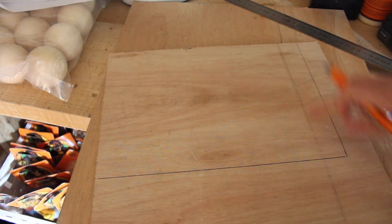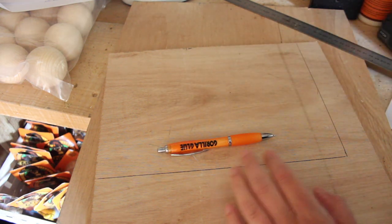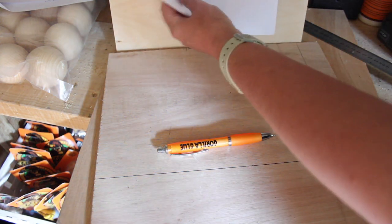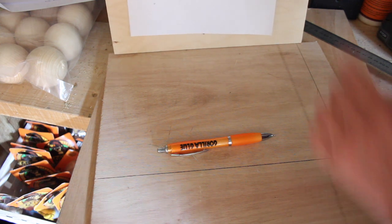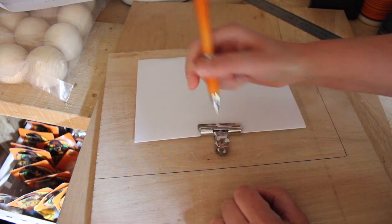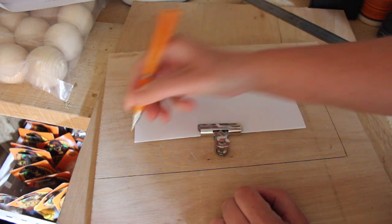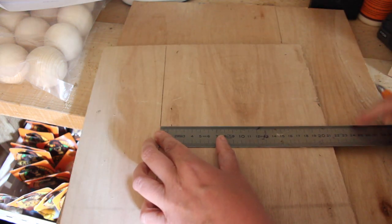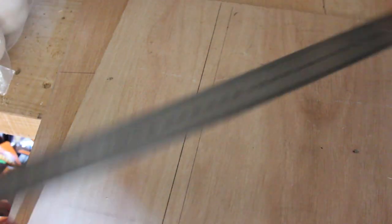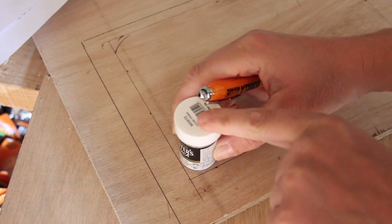What we're gonna do now is cut a hole in the thicker piece because your pencils are gonna lay in there. The thing you have to keep in mind is when the lid's there, the lid's gonna have this bulldog clip and the paper. When it falls down, we need to have enough space for the bulldog clip to sit in the recess we're gonna cut. I worked out it needs to be one and a half centimeters where the bulldog sits, two and a half centimeters on the sides, and the back is gonna be four centimeters. We're gonna measure and draw this out on the plywood and then make nice rounded edges on this recess.